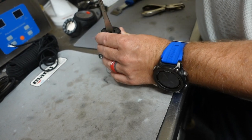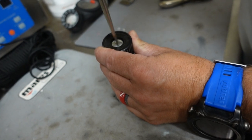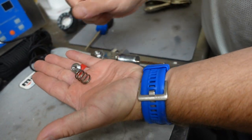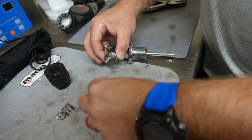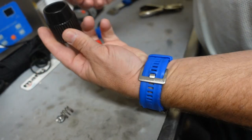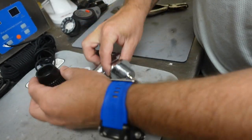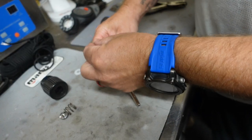As I take these off you'll see it's very simple once we get the tension off the spring — we can just slide it off. There is the spring and the slotted nut. Here is the turn wheel itself, and on the valve body you'll see the little spacer — basically just an anti-friction ring. What it does is sit up against the metal inside the turn wheel so you don't have metal-to-metal contact creating corrosion.